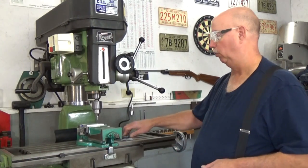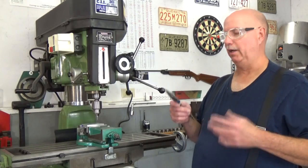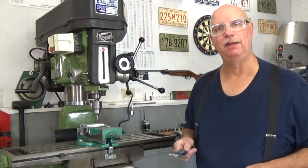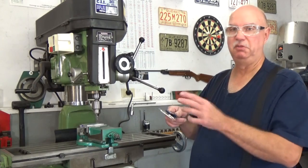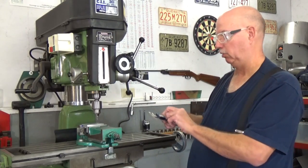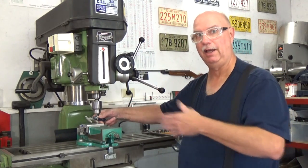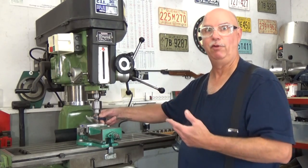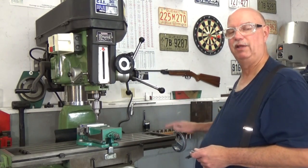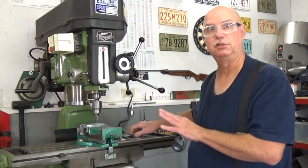You may be wondering about the digital calipers. This isn't something I use to be accurate — it's to check that I'm not making any mistakes. I set it to approximately a thou or two around where I want to be. My X had to be at one inch, so I set it to one inch. When I touch off the part, I check from the scribe line at the center to where I wanted to drill — if it's close to one inch. If I make a mistake, it won't be a little mistake, it'll be something like a full turn of the handle. It's just a safety check.